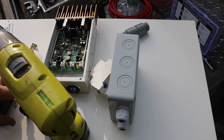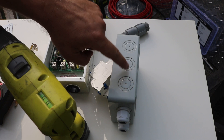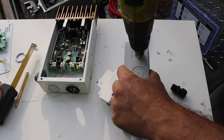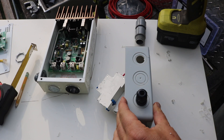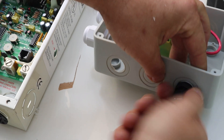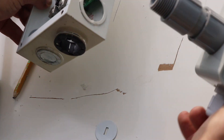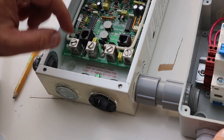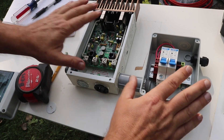On this side I know I'm still going to add two more solar cables, so I'll drill these two out to match this part. Then I put in the cable gland and screw in the nut that goes on the back side of it, just tightening the whole thing down. Pull that out, stick this in, put a lock nut on here, and then I can get those screwed down.